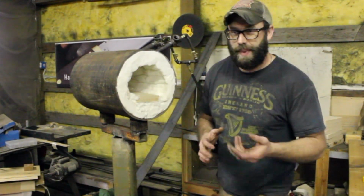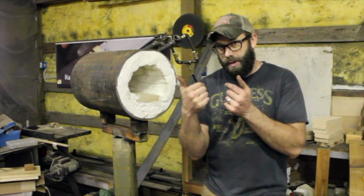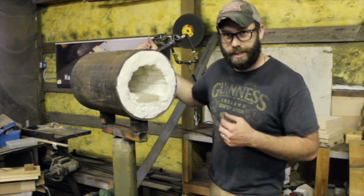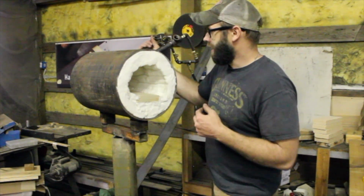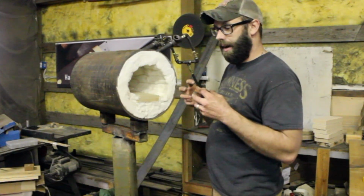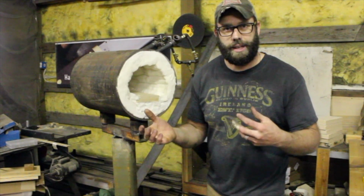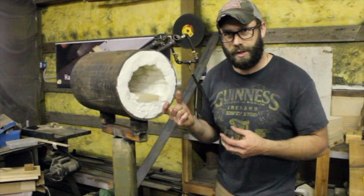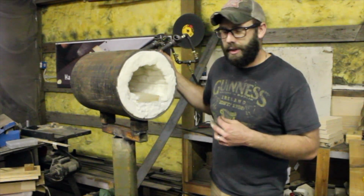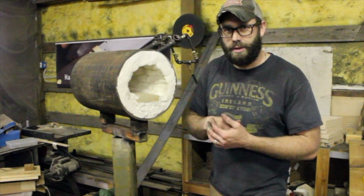Okay, so as I expected, once I put this insulation in here and made it a little wider than the Venturi tube, that acted as the necessary expansion at the end of the tube. The flare, that's what I'm trying to say, the flare at the end of the tube. So especially with this thicker insulation, on the final design of these burners, you don't need a flare. These are just a 3/4 pipe slid into an inch pipe right into the body of the forge.